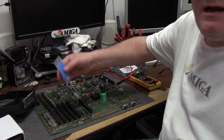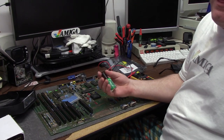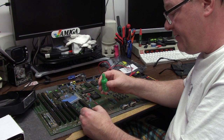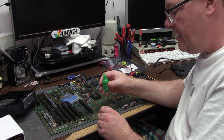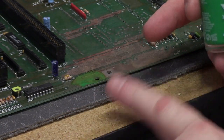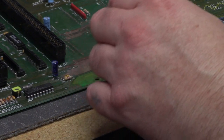The resistor pack and a couple caps were in here for this area. I don't have an exact match of green for the solder mask. I always use a really thick non-metallic fingernail polish — it works really good. I don't have any actual solder mask left, but I do need to cover up this. So what I do is I get a nice little coating on here and just give it a tickle ever so lightly. You want to cover it up enough so the copper will be green — it's going to take a couple of coats.